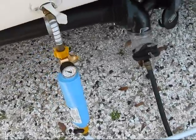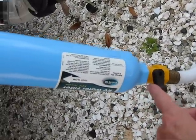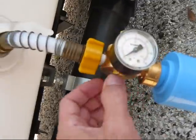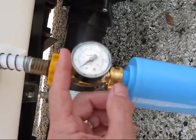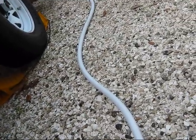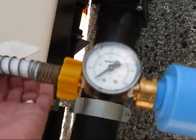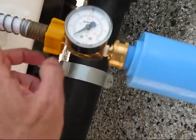The one last thing I wanted to show you, since we're playing with water, is my setup here for my water going in. I have a shutoff valve here, and then one of these RV water filters, which I think are really good. And then I have a Watts adjustable pressure regulator. What I'm doing here is cutting it down to 25.